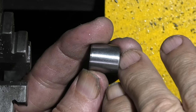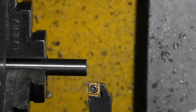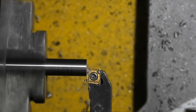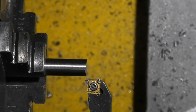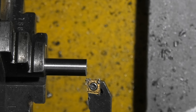Now starting on the lower pivot, which is made from silver steel. Let's face that off and zero my X and Y. I need to come in 3/8 and turn that down to 3/8 long and a quarter inch diameter.